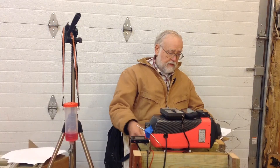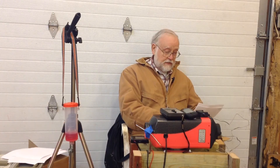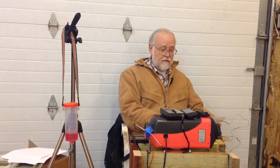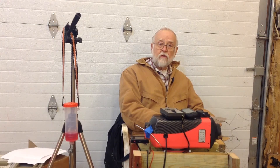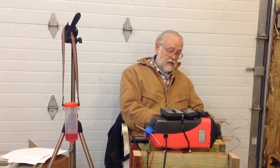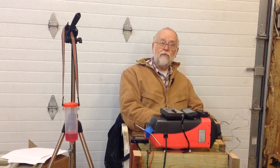In summary: first, thanks to my son for giving me this heater as a Christmas present — it's given me hours of entertainment. Second, I believe this heater at its current settings has a maximum output of about 10,300 BTUs per hour with a thermal efficiency of about 70%. That's not great, but it's within the typical range of older furnaces, though modern units can reach 80–90% efficiency. The manufacturer's kW rating appears to be a calorific value — a fuel energy density — which doesn't give you heat output as a function of time until you apply the fuel consumption rate.